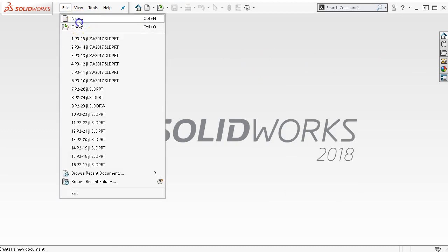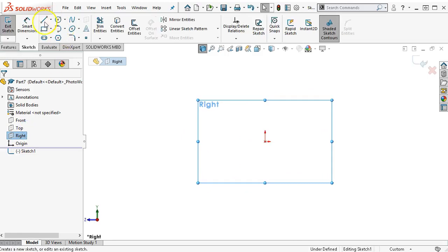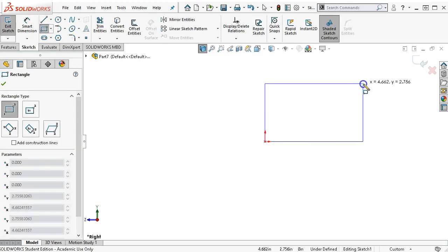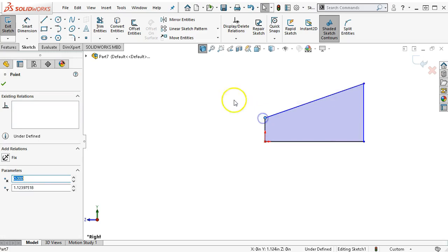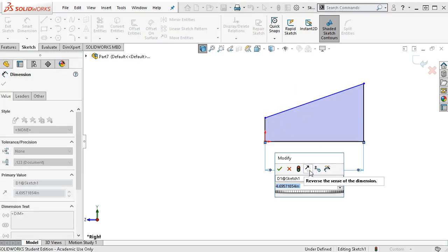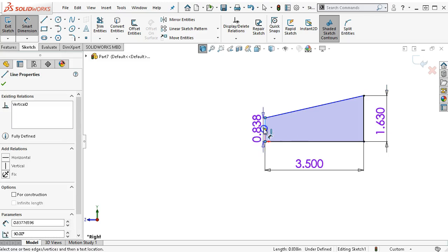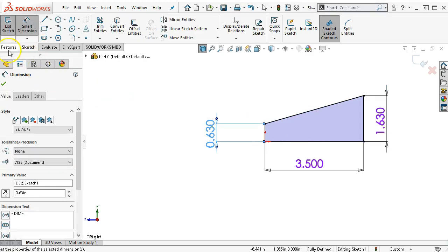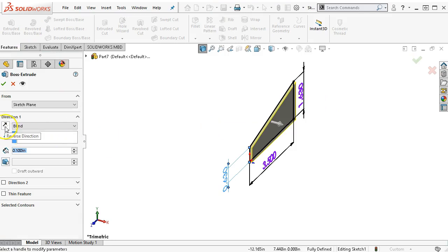File, New — this is in inches. Let's go into the right plane and create a rectangle. Rectangles are still pretty useful even with the angle because I can get rid of one relation and turn it into that more trapezoidal or angled shape. So 3.5 on the length and 1.63 on the height, and we have 0.63 on the other end. The feature will be to extrude to a distance of 2.38.